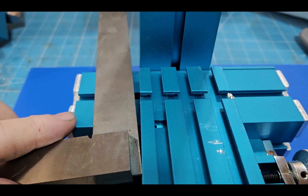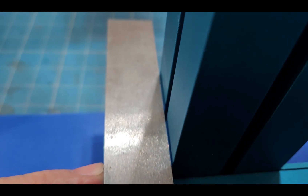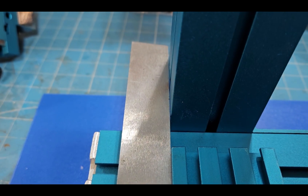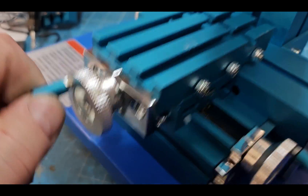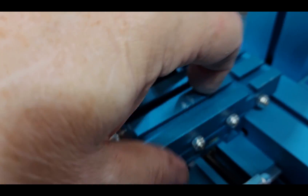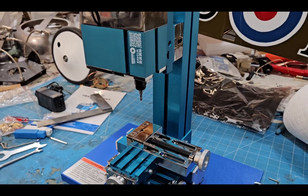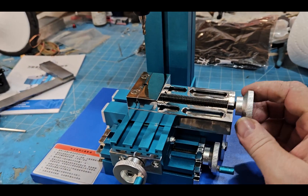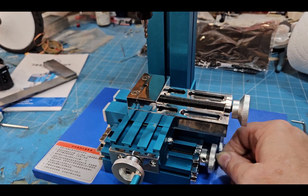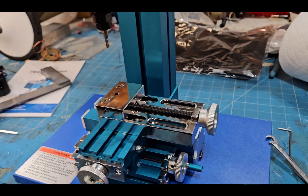Next I'm going to make sure we're straight — there shouldn't be any gap all the way across, even to the tower itself or the Z-axis. That looks pretty good. To get to those screws to adjust it, you've got to slide this all the way out and then there are two screws that go through to that nut plate. It's all pretty much tightened down and it's a little stout to move, but that's okay because you don't want a lot of backlash in it.